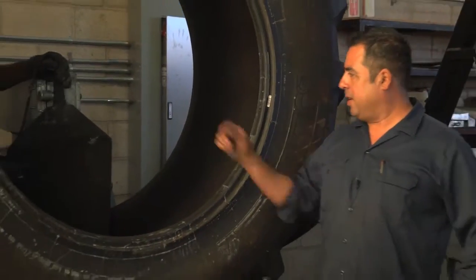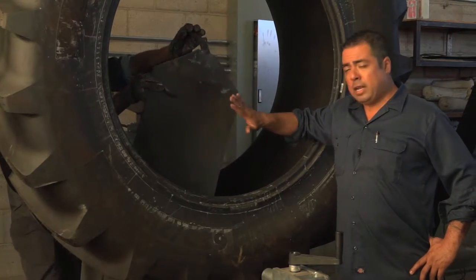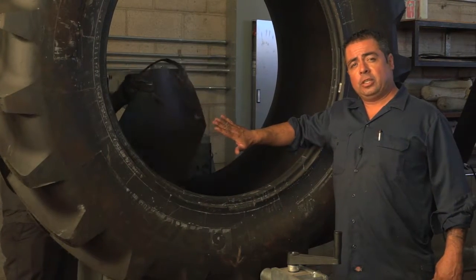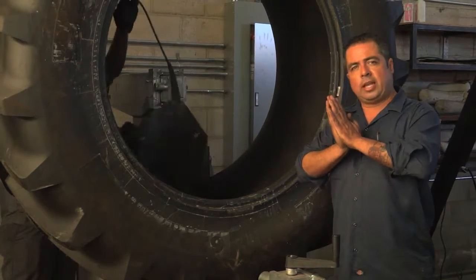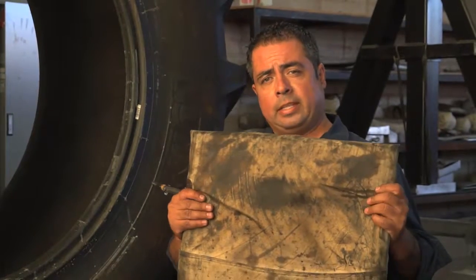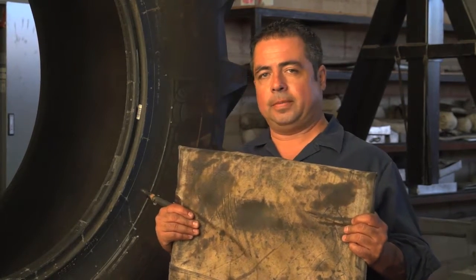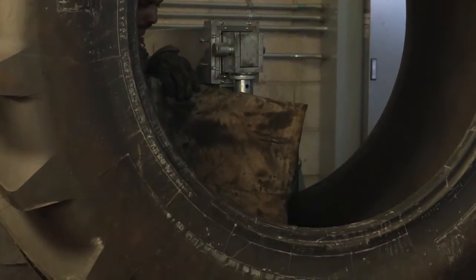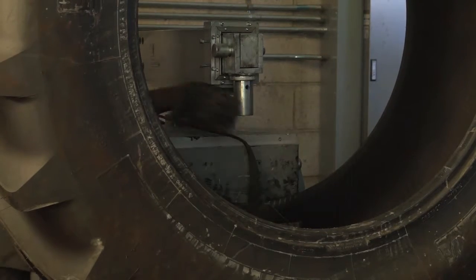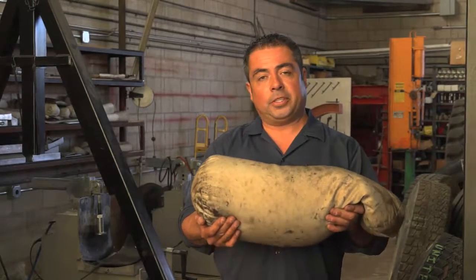This acts as an oven — this is a heat plate right here. A heat mattress goes to about 450 degrees. We lay it right on top of the patch, so you put it on the inside of the patch with the billet on the outside, and it cooks it like an iron. We'll put this air bag that inflates up to 35 psi with pressure right on top of the heat mat — that's the second process to it. Our next process is these silica sandbags that transfer and radiate the heat nice and evenly. Very smart engineering to this.